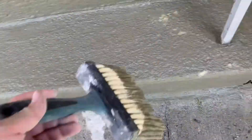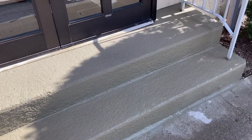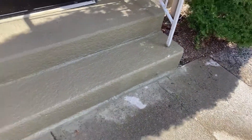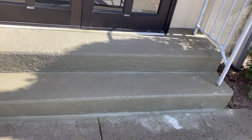You just take your brush and — like the legend Mike Haddock says — you just paint it with the Portland. For this spot this is gonna work just fine. I'm gonna clean that little detail here with a wet wipe. For this side step I think it worked well. This literally took maybe 10–15 minutes. I soaked it all in water, got my mix together, started mixing up my dry mix, let the water seep into the crevices, mixed my mix in a small bucket — really small batch — started painting it on. We're gonna go up to the front and do the same thing.